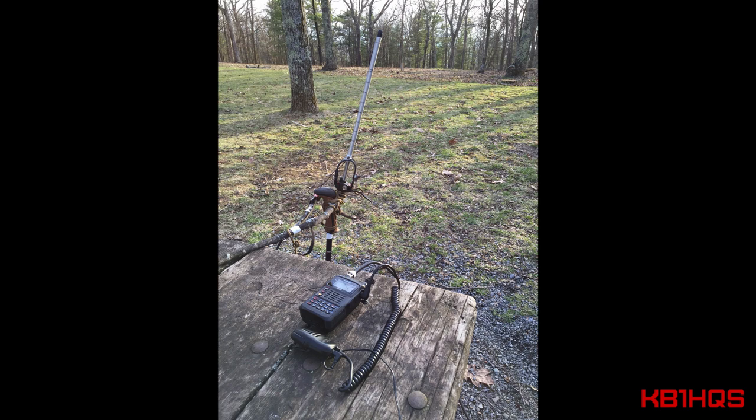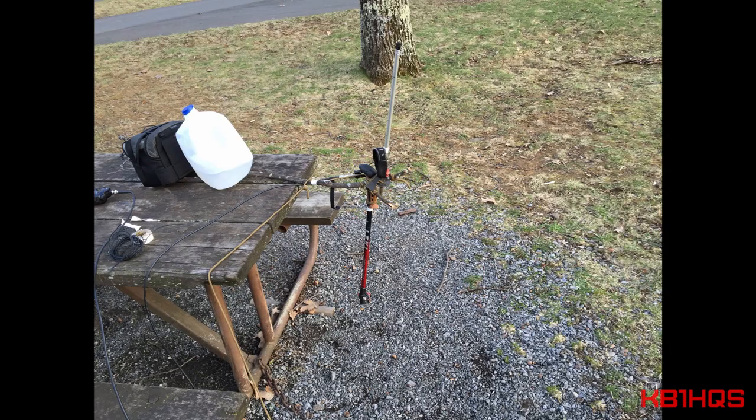At the end of the day, if you have some materials that'll radiate, that's pretty much all you need. I will say, having a BNC-to-banana adapter — you should have one with your kit, because if you have to make some kind of a field emergency antenna like this, that thing will save your butt. With a multi-tool, a little miscellaneous wire, and some tape, you could do a lot. Your antennas don't always have to be good looking or expensive. You can just craft them up, but you need to know the measurements, the formulas, and maybe have a wiper blade — or at least a measuring tape — on hand. Thanks for watching and have a great day. 73.